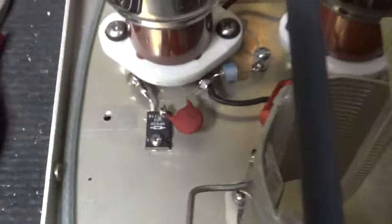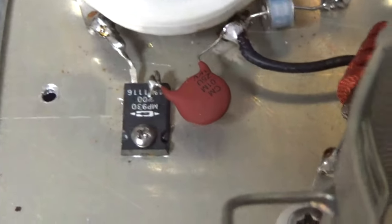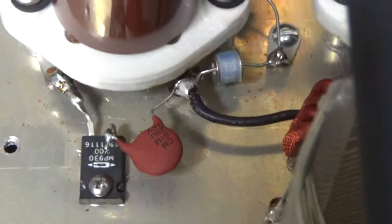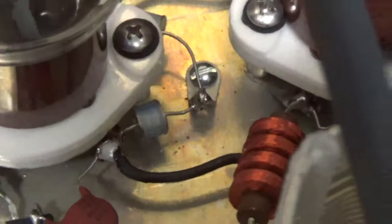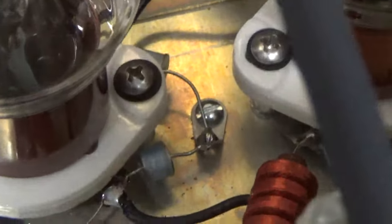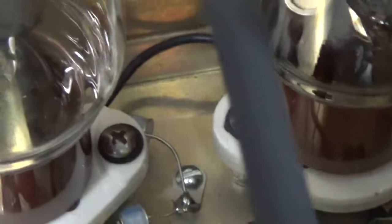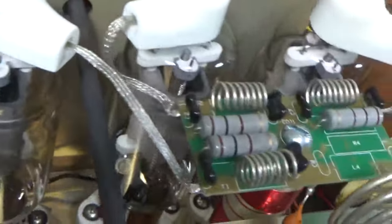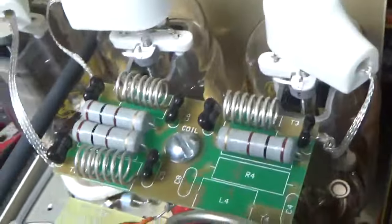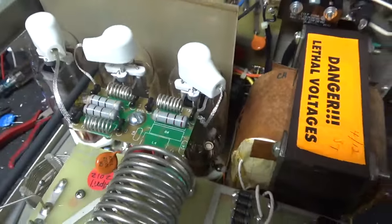So, I reconnected one of those 200 ohm resistors. I put thermal paste behind it. It did not have any. Fixed the solder joints on the sockets, compressed the clips, added the gas discharge tubes right there, removed the other ones which were not correct. Changed the SO239s. Tightened up other hardware. Got a brand new set of Penta Labs tubes. Zip tied the wiring.